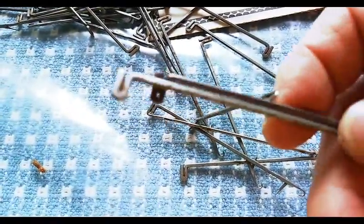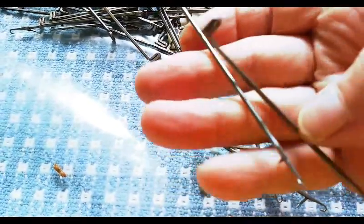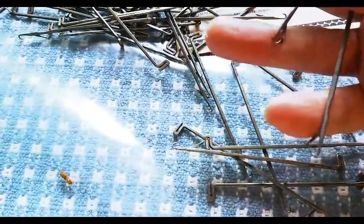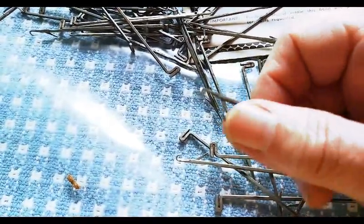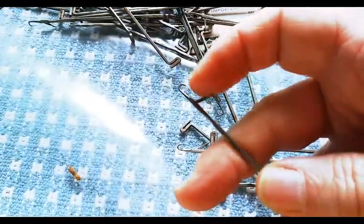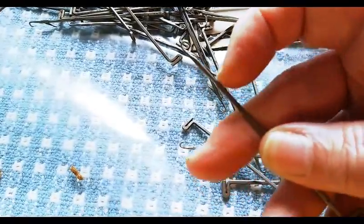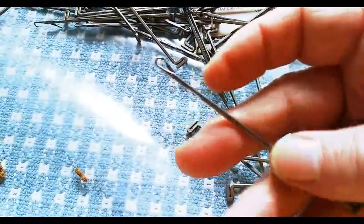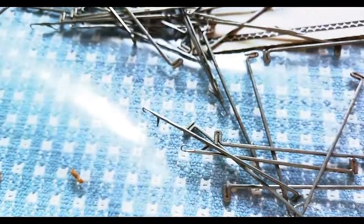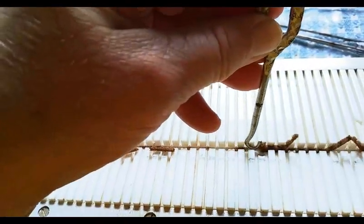The needles — as I suspected — somebody in the past has superficially removed rust, because it's not just encrusted on there, but they're not smooth. They're going to work better if they are. Neither are they ruined, and all the latches seem to work. So I think what I'm going to do is give them a quick going-over with steel wool and then dump them in Marvel Mystery Oil to soak while I do the rest of this. I'm very happy to see the latch working as well as that.